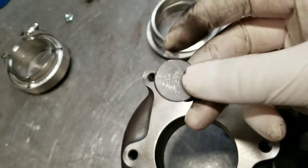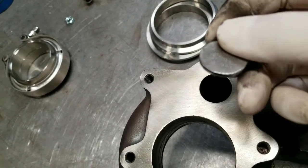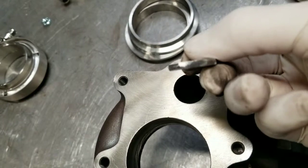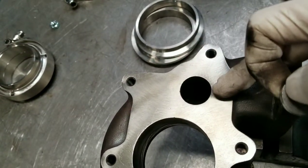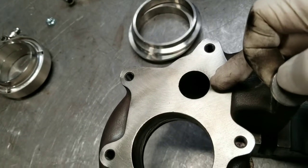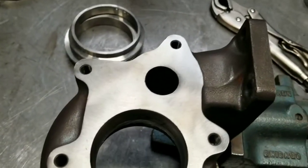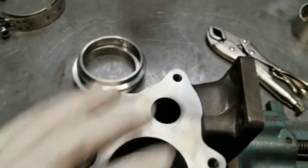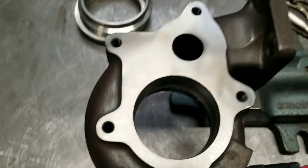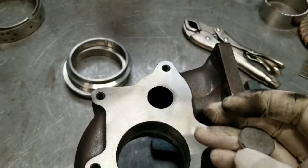That's what it looks like beveled. I'll use a magnet square — I'll put it across and let the plate stick to it so I can tack it in place. Let me get that cleaned up and beveled and I'll show you what that looks like.